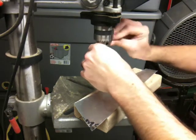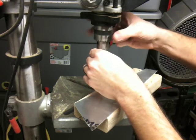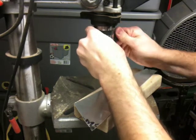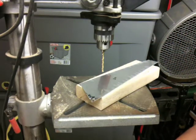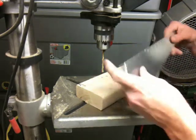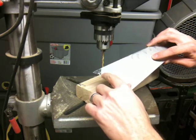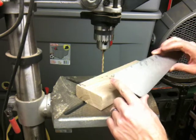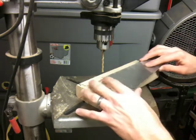The first thing I'm going to do is get a drill bit, kind of a starter bit. This bit is big enough to do the hole for where my temporary screws are going to go through the center of the rib, here and here, through the mounts of the form block. I'll drill those two holes which I've center punched, and then I'll drill these two starter holes. The plans call for bigger drill bits, a quarter inch and five sixteenths, but I don't want to go straight in with that big bit — I want to get it started so I don't wobble and get it straight.